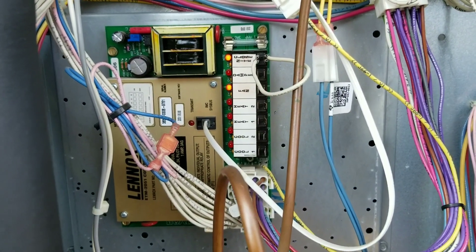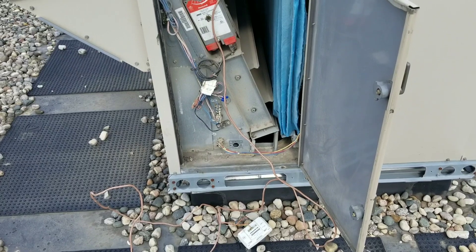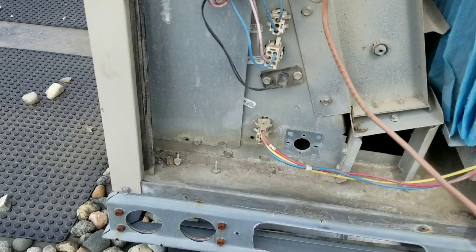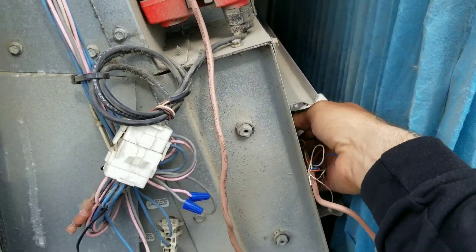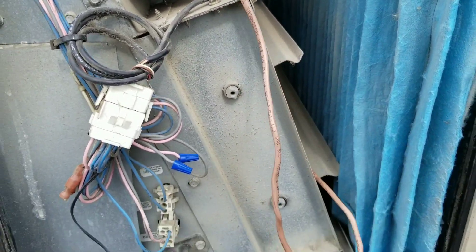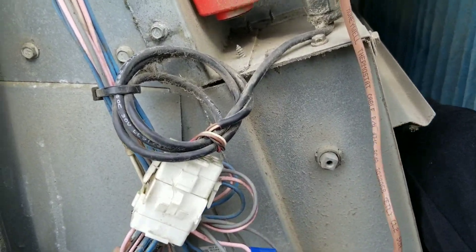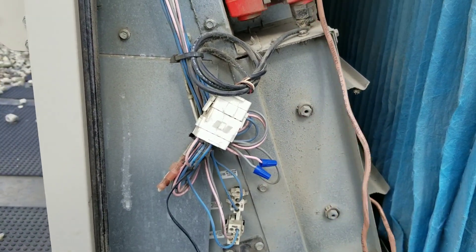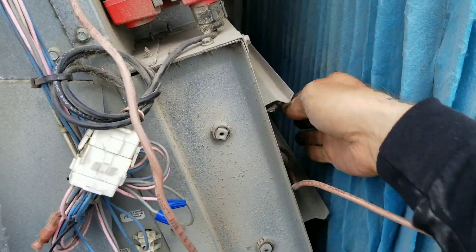So that's what I'm going to do right now. I'm going to get that wired up, and as soon as I'm done I'll show you the final product. I got my temporary thermostat wired in place. I'm going to drop it down my return vent and then we're going to power this thing on. Keep in mind guys, this is just an emergency repair — this isn't something I do on the norm to get around actually fixing stuff. But one day this video could save a long and drawn-out phone call trying to explain to somebody how to do this over the phone.